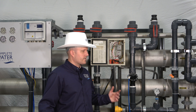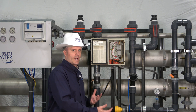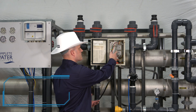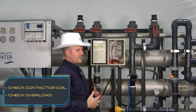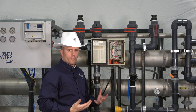The next thing you may want to take a look at, especially if all else is running — the RO system's on, the inline solenoid valve is open, you've got water flow through it, but your pump isn't running — take a look at your overload or your contactor. Make sure that this is pulling in the way it's supposed to, and then check your overload. Make sure that that's not tripped or popped on you.